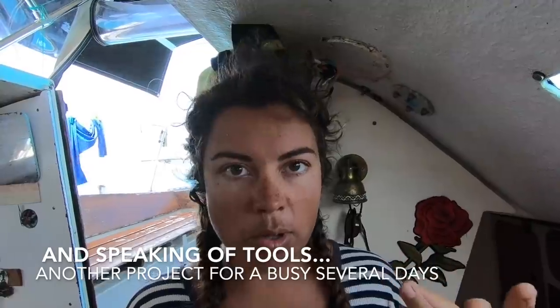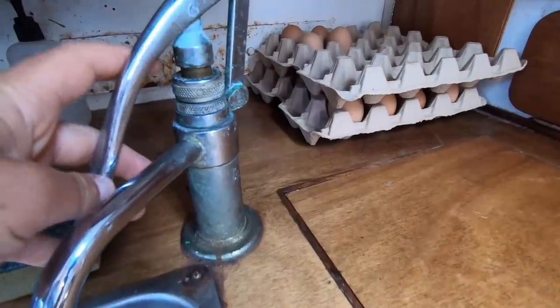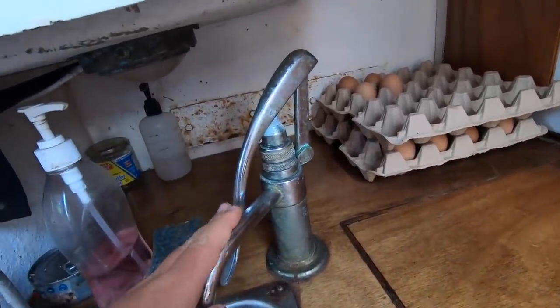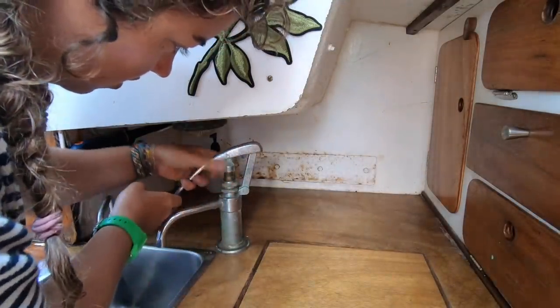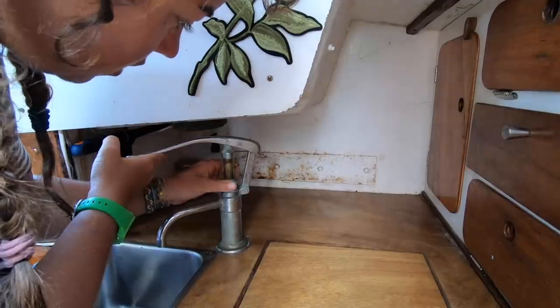I have two water taps on my boat. One is for salt water and it's a foot pump, and the other is for fresh water and it's a hand pump. I bought this pump secondhand online and the gasket on it was a little bit blown. When I was overhauling my boat, my dad showed me how to cut a new gasket for it out of leather, but it doesn't always hold up very well. When I was in Panama I had to fix the gasket because it stopped priming, and now I have the same problem again. So I'm going to take apart the pump, pull the gasket out, and try to clean it. Last time I just fiddled around with it and it started working again. I also have another piece of leather I could cut a new gasket from, worst case. Now it's priming because I just primed it to fill my water bottle, but I've been priming it with my mouth — which is one of the good parts about living by yourself.